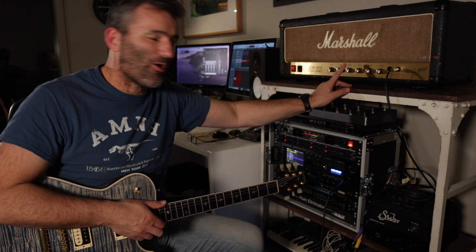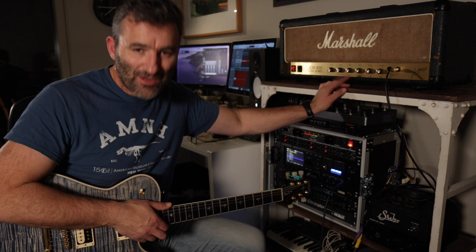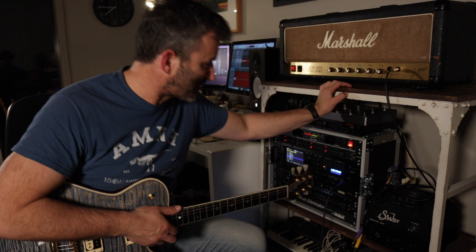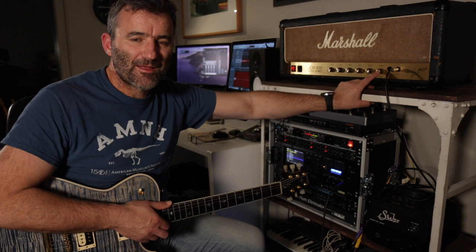It's a 1985 2203 horizontal input model, right? So we know that means it has a pot-mounted PCB in this amp. I posted a clip - I've got a 2204 of a 1986 variety from memory and showed how we took that back to early 80s spec. This amp sounds pretty good straight out of the gate. I've just literally plugged it in, going through some basic tones. I've got everything pretty much set at midday, the master at about 10 o'clock, and the preamp going at about 3 o'clock.